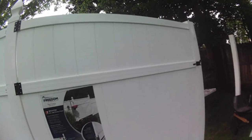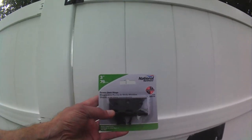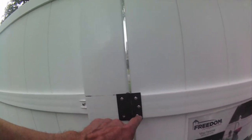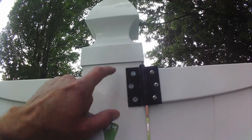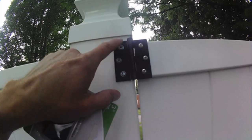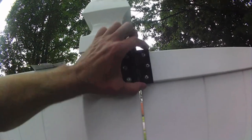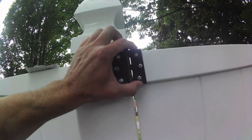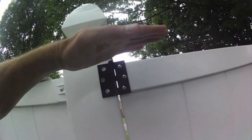What I've done is taken one of the regular panels and put three hinges on it — these are three-inch storm door hinges from Lowe's. I would not use the screws they want you to use for the brackets because one broke off on me. I'm using long one-inch self-tapping screws. When you mount the hinge there's some flex, so you want to mount it level and take all the play out so the door doesn't fall down.